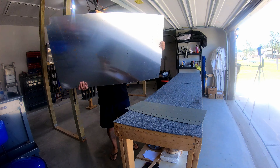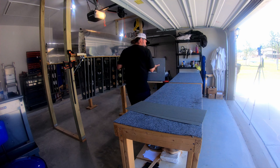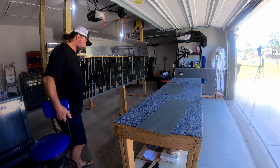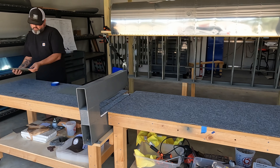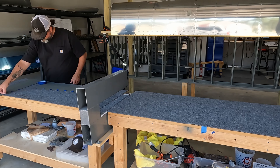Today, like yesterday, it's a lot more of the boring prep kind of stuff, which is apparently what a lot of airplane building is. Let's talk about this DRDT2 setup that I have - you've seen it before. I've got some tracks set up between my two tables so I can run the whole thing flush on the table. I like this setup because, especially when we get into the big outboard skins, I'm able to keep a lot of that floppy skin on the table while I'm dimpling.